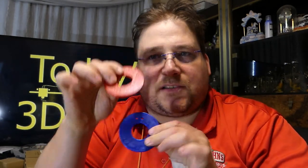That's why we usually try to stay at about 75% of your nozzle diameter. So if you want to do a 0.4 millimeter nozzle, you really don't wanna go past 0.3 millimeter layer height, and unless your printer is very good, 0.3 millimeters is really pushing it. We typically like to stop at like 0.28. So think of it as like 70%, okay? I don't know what the science is behind it, that's just the way the math works out. 70% tends to be reliable. Anything over 70% and you're running into unknown territory.